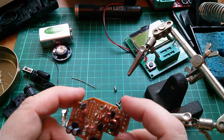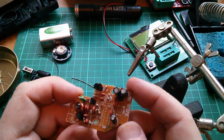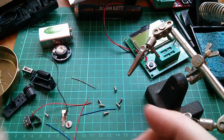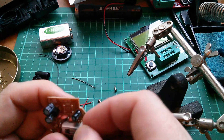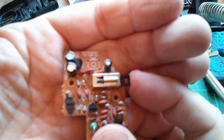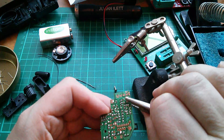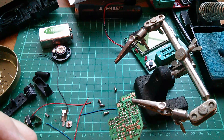Remaining parts to be soldered on the board - still haven't got R10. If I can't work out what R10 is, I'll just shove a wire link in there, but I'll try it without R10 first. It's just a mystery that it's not on the list. That's the switch in - the push-button switch. This is really a one-hit thing because there are so many legs on this thing, it's not going to come out again without a lot of sucking.